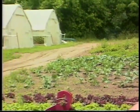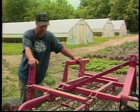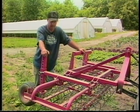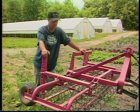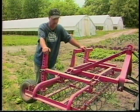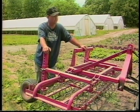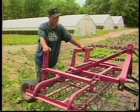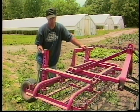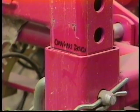This is the Lele Weeder that we acquired last year. It cost us in the vicinity of $1,700 to $1,800. We bought it with the gauge wheels, which is an optional thing. I like it because it controls the height a little better. If you're in an area where your tractor makes a little dip, you don't have that action of digging in — the gauge wheel floats it and gives a little regulation and flotation over the top of the crop.